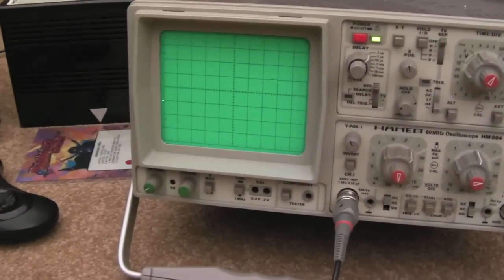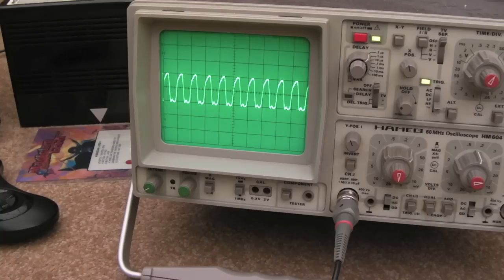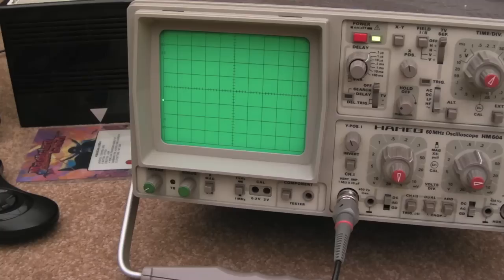I've got a scope. To start with I'll just show you the 8MHz clock - that's the normal clock pin going to the CPU. You'll notice it's not a particularly well-formed waveform, probably a combination of the probe and the fact that I haven't calibrated this little trim pot there, which needs twisting to get a better shape to that signal. But as you can see, at 8MHz we've got one division per cycle. And if I just jump onto the other pin - I think this is my 16MHz - yeah, that's looking like 16MHz. You've got roughly two cycles within each square. So that's the 16MHz clock as far as you can see. The amplitude is very similar as well. I'm going to give that a try with pin 39 and see how I get on.